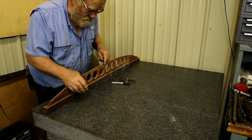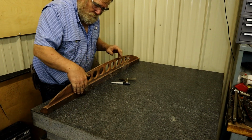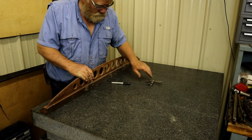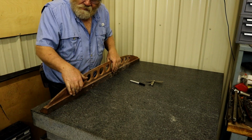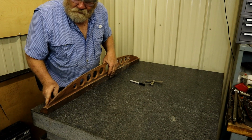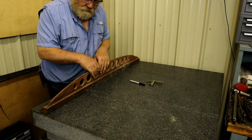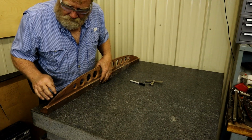This is not parallel to any surface but a banana. So usually what I do is I plane this surface, and I use it as a reference for this 45 over here and the flat. It gives me something I can go off of. This is all cattywampus, so I don't really care about that. It's just holding it.